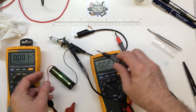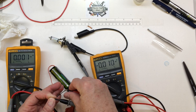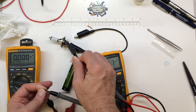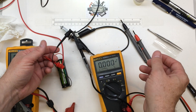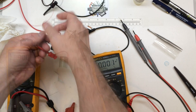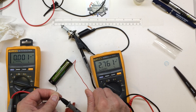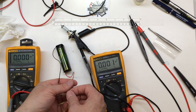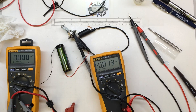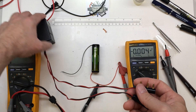We'll take the load off and we'll see the voltage goes to zero because the safety shutoff circuit is activated. To reactivate it, we put some charge on it just for a second to bring it back to life. It cut off around 2.75 volts — that's good. It protected it very well from over-discharge and it came back fine. Happy with that.